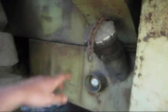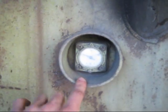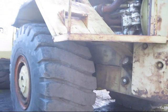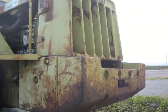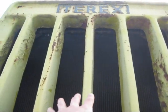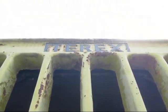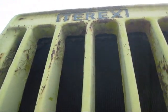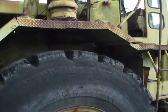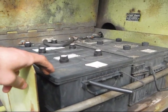Around the back here is where your fuel tank is located, with the cap to fuel the machine with diesel fuel. This gauge tells the operator how much diesel fuel is in the tank. On the back of this machine is a three-section counterweight. The uppermost piece not only acts as a counterweight but also as a guard to protect the radiator, which is right behind it. Up on the top you can see where it says Terex. Right here you can also see where the batteries are stored for this machine.